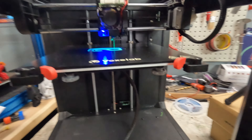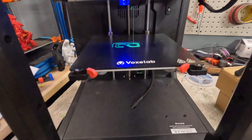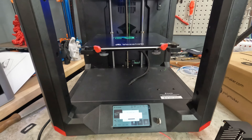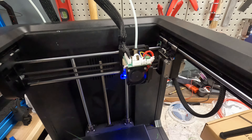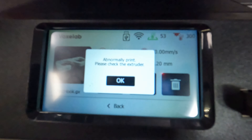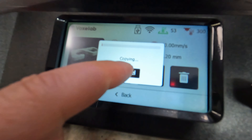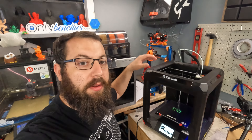And, as you can see, the bed is dropping. Canceling build. The thermistor looks like it's spiked up to 300. Bed is dropping. I'm just going to wait and see what it actually says — if it tells us what actually happened here. It looks like it's going to park the tool head. There you go. Abnormal print — please check the extruder. As you can see, it's still reading at 300 for the hot end. So, it has some form of thermal runaway.